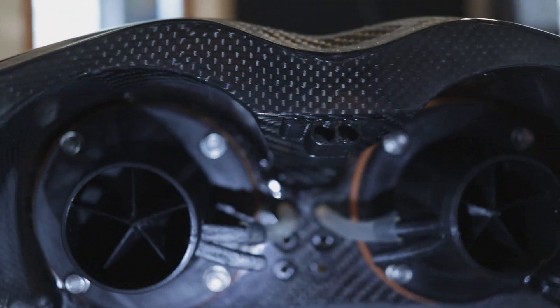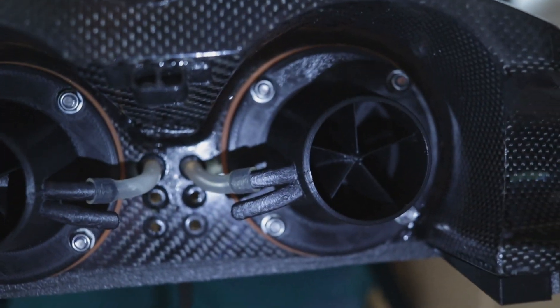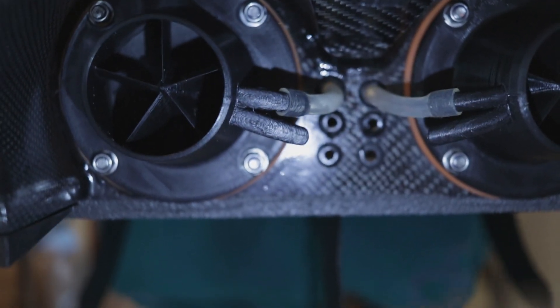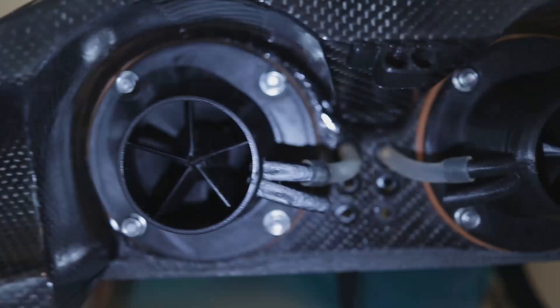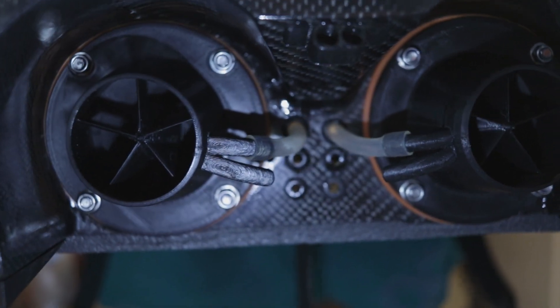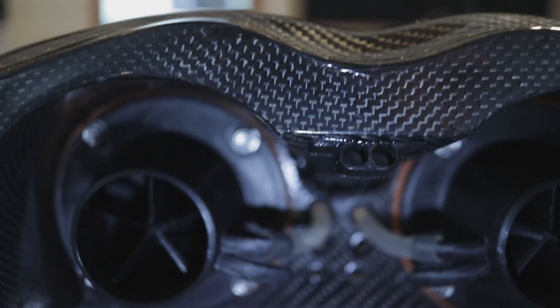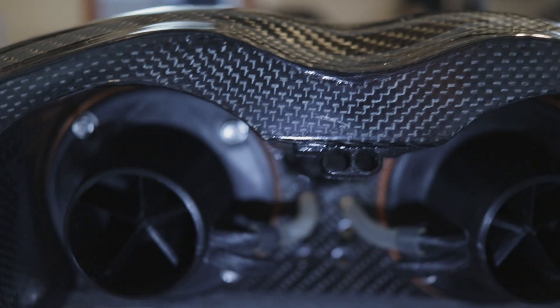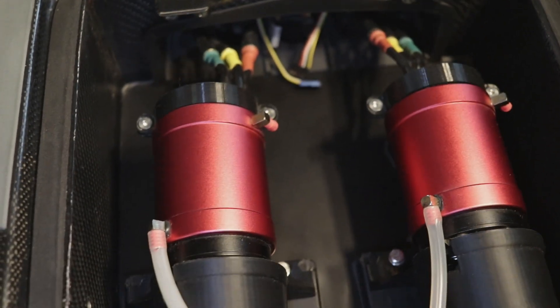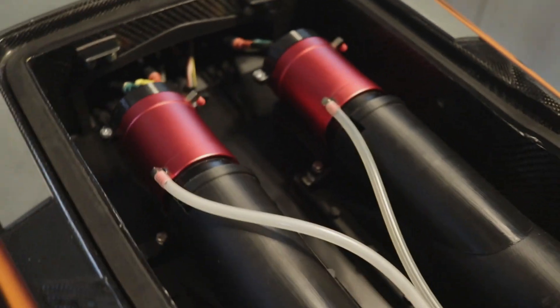Now here you can see I haven't finished quite 100% yet, but I've got the water pipe on one of the nozzles — on one of the outlets. I've drilled the six holes in the transom plate, the nozzles are on, props are in, so the water now just needs connecting. I need to buy a little bit more silicone pipe — a guy up the road does that — and I'll put a little printed pipe holder for the pipes to come out. That's the outlets, and then I need a couple of connections, some more pipe and some T-connectors to get connected into the outlet so it can blast its way out.